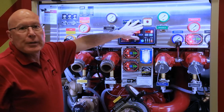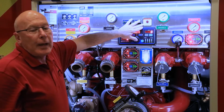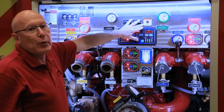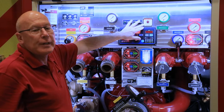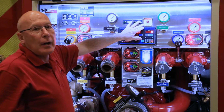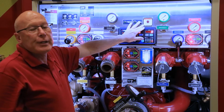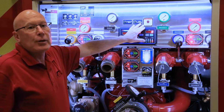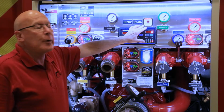For safety purposes, we have incorporated the Darley pump overheat system. If, by all means that have been incorporated at present for keeping water in the pump and keeping water flowing, we still encounter a hot pump or a warm pump, then we have an overheat protection system that allows that over-temperature water to be exhausted out to atmosphere and fresh, cooler water drawn back into the pump.